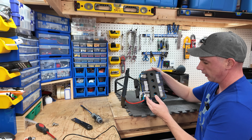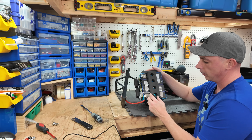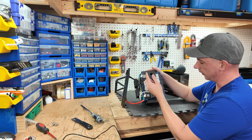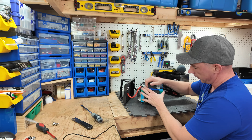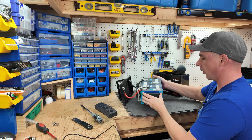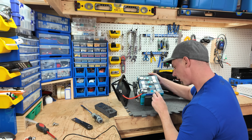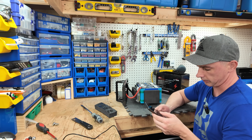Here are the battery cells themselves. We have laser welded bus bars, and these bus bars actually have a hump in them, which is great for expansion and contraction. Everything is neatly wrapped and zip tied. We have a hydraulically crimped lug — everything is glued. Even our balance lead cables are glued and screwed. They've also put in little pieces of tape to keep all the balance lead cables in a nice spot and clean. We have a QR code marked 04Q.